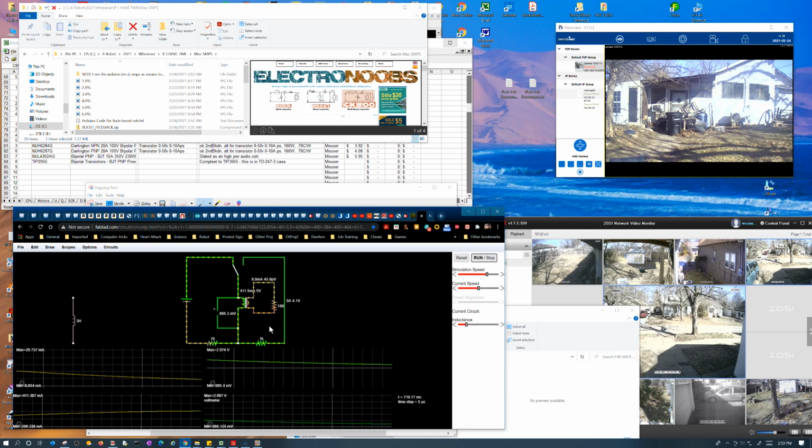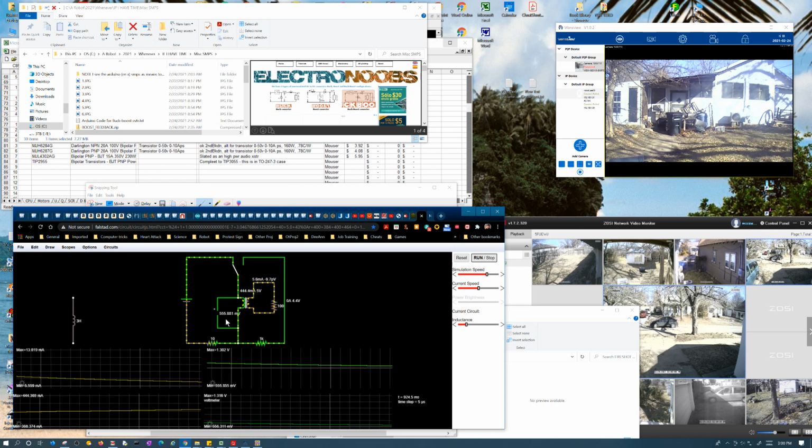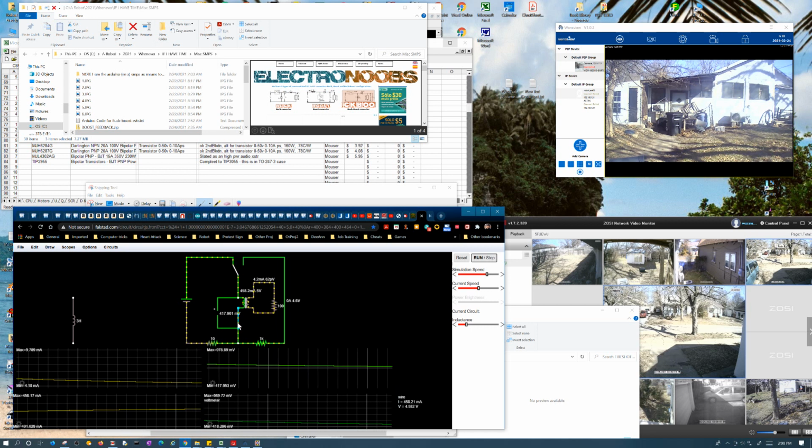But you notice a fraction of that energy disappeared really quick through the resistor, but like I said, at this point the dI/dt is so low, this isn't really using up much of our energy. Most of the current is actually going into the magnetic field at this point, because again, since this was an impulse, it's a dI/dt thing, and that's why we had a very high initial response to it. But now as that charge rate dies down, this is less and less effective, and most of that energy is actually going into the magnetic field now instead of being dissipated by the resistor.